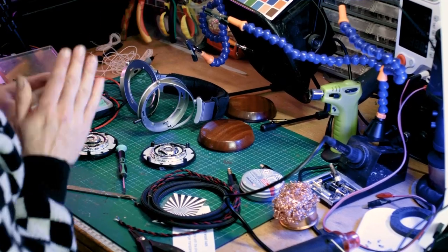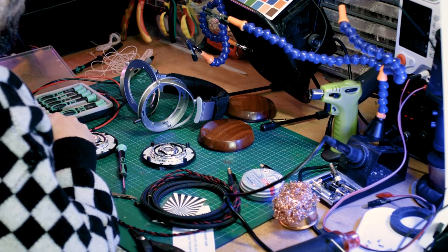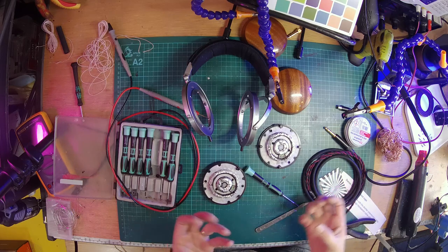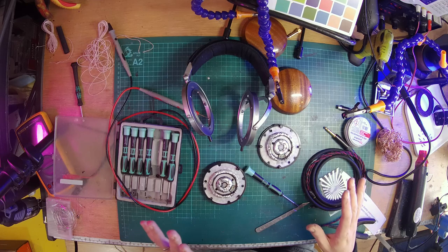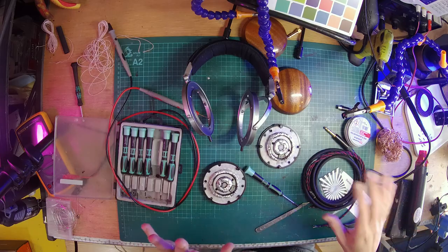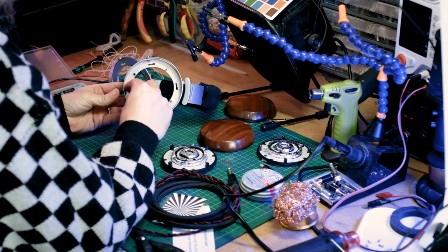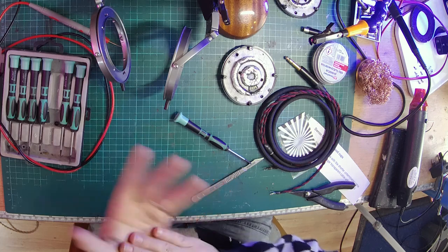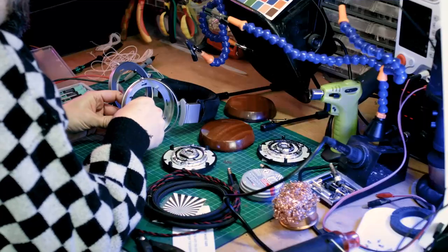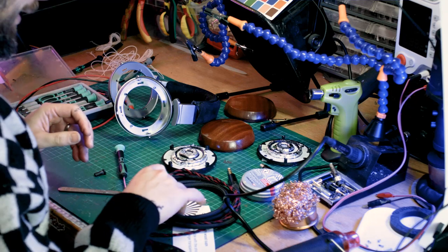The original cable is now removed and I've cleaned up a lot of the glue. It's a little bit scary because the glue is right by where the voice coil comes in — glue and voice coil wires are not friends. You can permanently brick a driver if you're not careful. I've tested both drivers and they still work, giving 24 ohms, and they're both measuring the same.